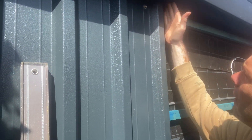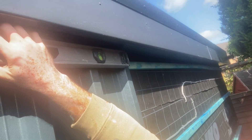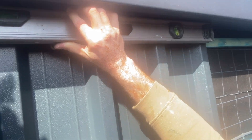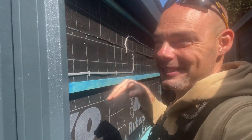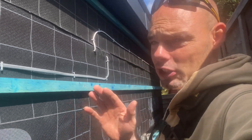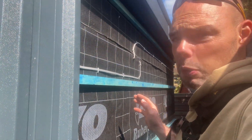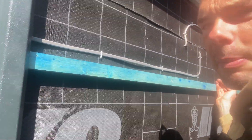Once this batten is physically in place, all I then did was get just over a metre level — 1.2 — butted it tight up to that batten and the soffit. Once I got it levelled, I then just measured the distance between the top and the bottom level, just in here. That way I knew that, in this case, 25mm — all I had to do was mark on the back edge 25mm down, then get my Festool and just cut my blade up to nothing. That gave me the perfect angle of the dangle. The next one will basically lap this part here, so the profile over here sits tight in this corner — I don't need to have the bit of batten to push up against.